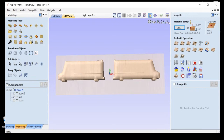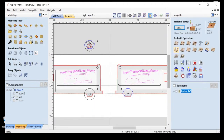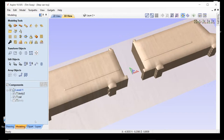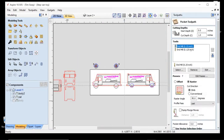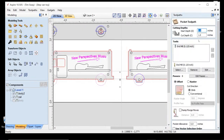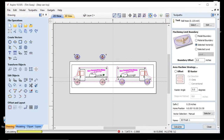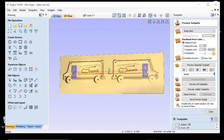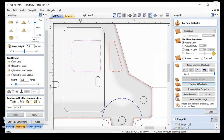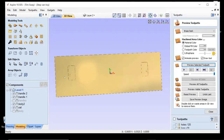Initially I thought this would be the end of my modeling and the rest would be done by just cutting in the toolpath. So I started experimenting with carving in the shapes, doors, and lettering. There's always a little bit of trial and error, and I ended up realizing I needed to add a door handle to my model - so I started over and rebuilt everything to the sizes and shapes I wanted. I had to take my eighth inch end mill into consideration when modeling these windows and doors to make sure it would fit in between the spaces.